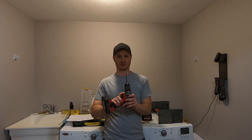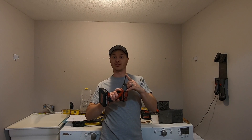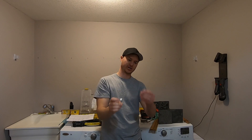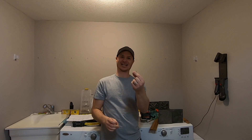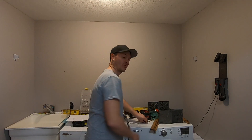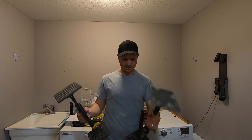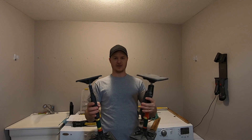So what are you going to need for installing cabinets? A drill, a pilot bit just a bit bigger than the screws you're going to put in, an impact gun with a bit for your screws, some shims, pencil, tape measure, some goggles. You need at least two clamps. You're going to need a two and a half inch screw with a washer head, and then to screw the cabinets together, you're going to need one and an eighth for five-eighths cabinets or one and a quarter for three-quarter inch cabinets. If you don't have the washer heads, you can use regular flat head screws and just put a couple cup washers. I like to use a four foot and a two foot level, and these jacks to jack up the cabinets in the right spots.